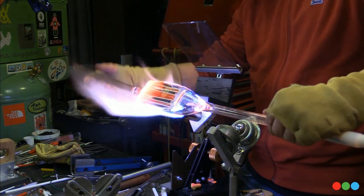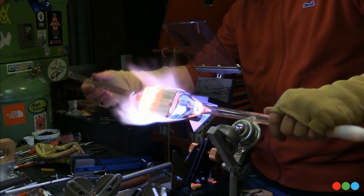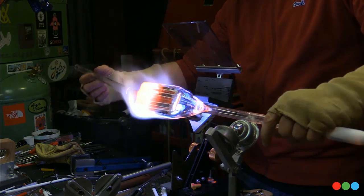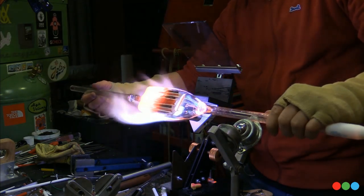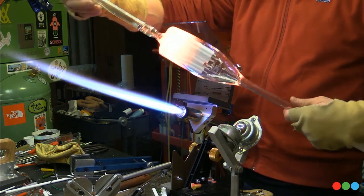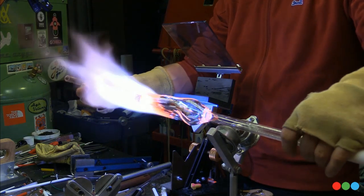I mean, it might work, don't get me wrong. But if you want to preserve crisp shapes, that's what you have to do: heat them along the way that the heat's going to flow into it. So the only way to get heat into these big wide sides is to give them more focus. If that makes any sense. If it were a cube, for example, you'd want to do one side, flip to the other, next side, and then flip to the next side evenly. A cube is a really good example to imagine because it's got sharp edges, right? If you just put it in the flame and kept spinning, those edges would round out. Eventually, it would just turn into a marble. So if you want to heat a shape like this, you really have to heat along its shape and kind of feed it the way it exists, so to speak.